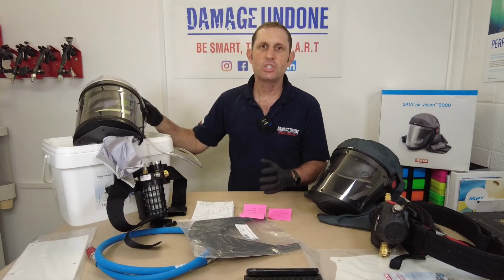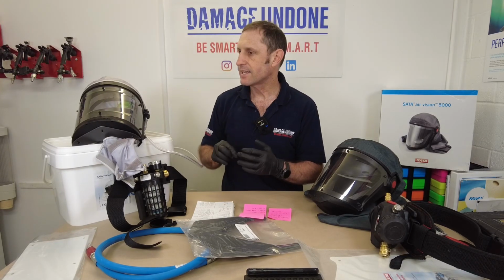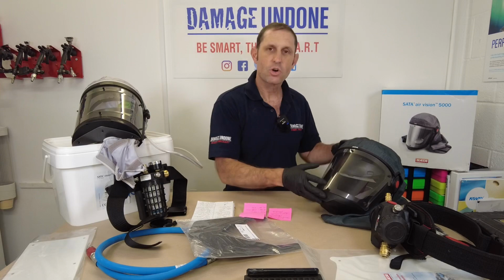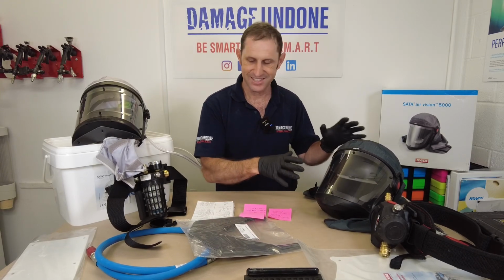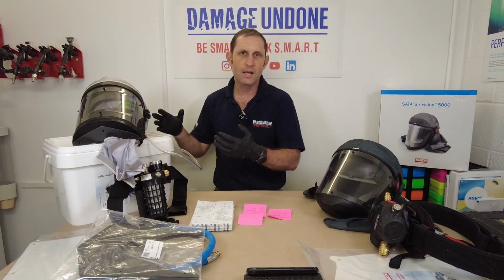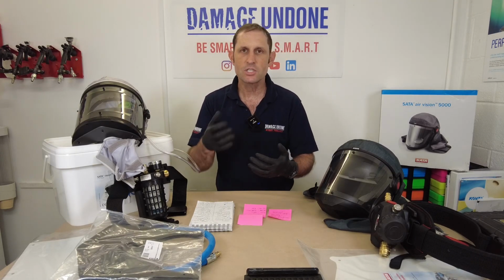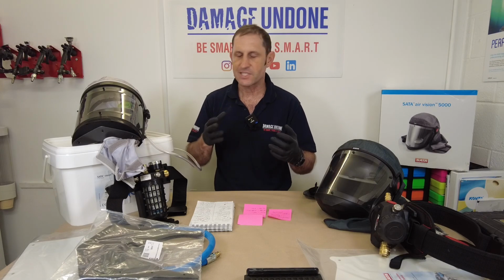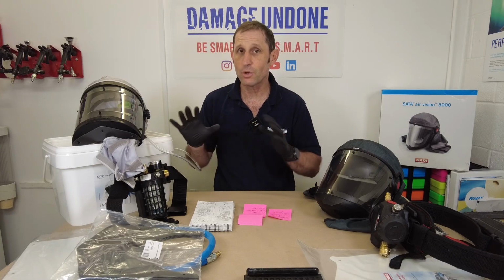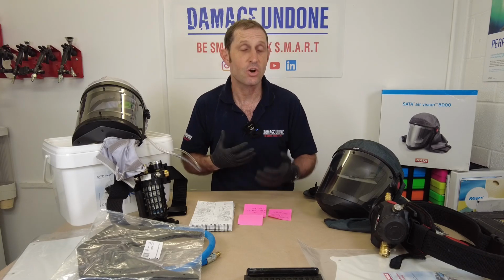Unfortunately, I couldn't use the Sata 2000 as much as I would like to have. And the reason for that is the alarm kept going off on it. This helmet and this system requires more air than the 5000. It threw me, because I rang Sata. I said, look, I'm struggling, I'm putting my mask on, it's fine. I put the gun on, 30, 40 seconds into using the gun, the alarm's going off, the whistle alarm. So I'm going to have to stop using it. I probably only did 2 or 3 jobs with it just to get a feel, and then I had to stop because the alarm is there to tell you you're not getting enough air into your mask.